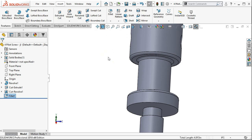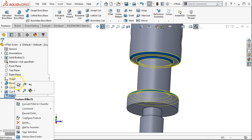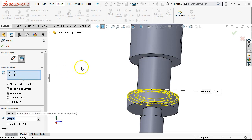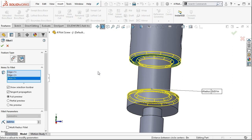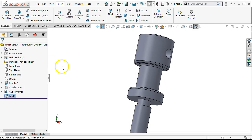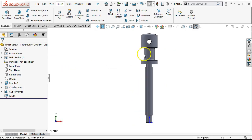By habit I'm going to pick my edges. I could have picked the face — let's do that as an example. Items four and three: if I pick the face, then all of the connecting edges will get the fillet applied to it. That's both the advantage and the disadvantage — if I pick this face, the top and bottom edges, but each of the whole edges would also get another 0.031 fillet. So it's not always desirable. Try the face fillet when it is handy, but realize you may be getting extra geometry as you go.